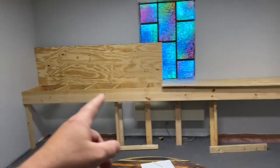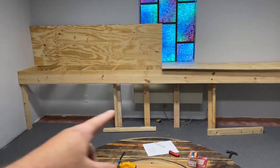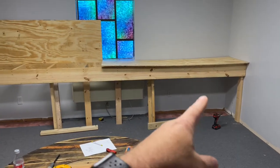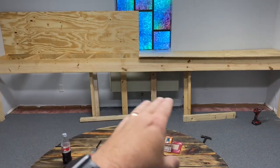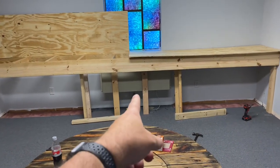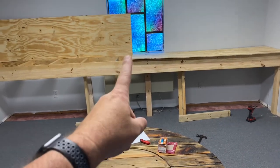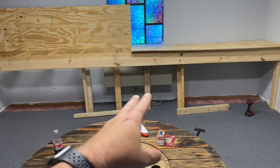Here's where we are. We've got our frame secured to the wall, strong and good, and we've put these legs in to sturdy it up in the center. Since it's such a long run, we definitely need that. We're also going to have shelves here. As we're closing in that old AC unit, we're unplugging it and doing away with it because we're dropping vents from the ceiling, so we don't need it anymore. That'll be covered up — you won't even know it's there.